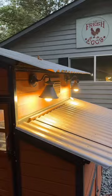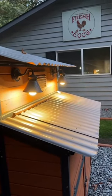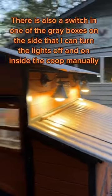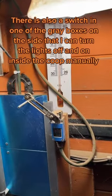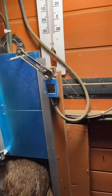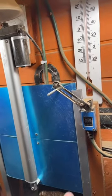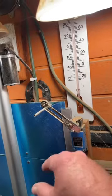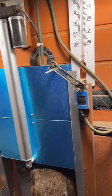That light is hooked up to these lights and that photo cell — those lights are on all night long. That's the kind of 'scare the scary monster away' type lights, so those lights are on all the time. Now that light is connected to the photo cell over there and to this switch, so when the sun comes up the lights go off inside, sun goes down the lights go on inside. When it's bedtime, this switch turns the light off inside. There's still power to it, so if the door gets lifted up the lights go on — door goes down, lights go off; door goes up, lights go on.